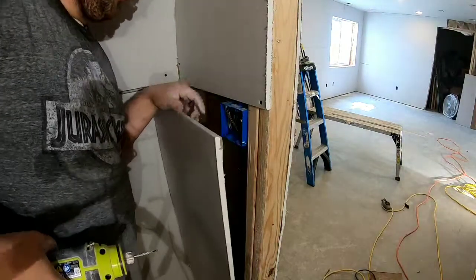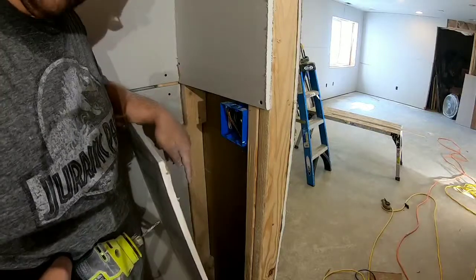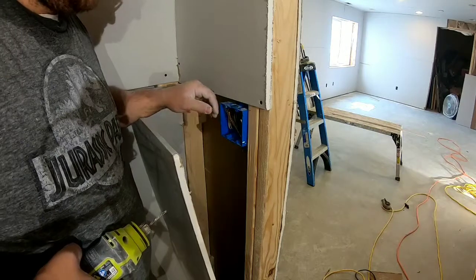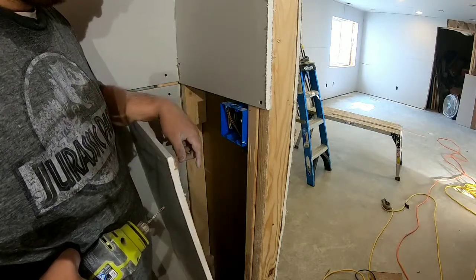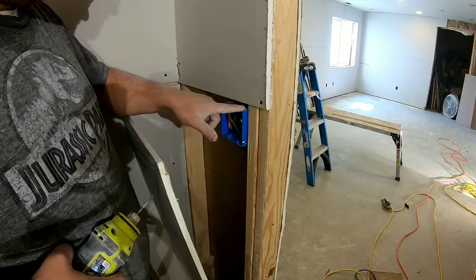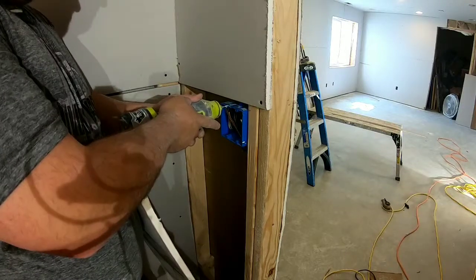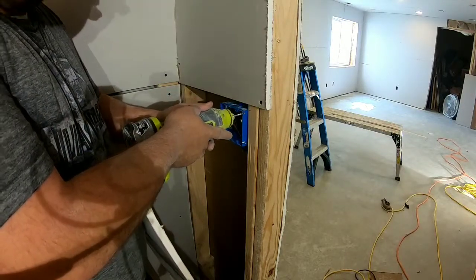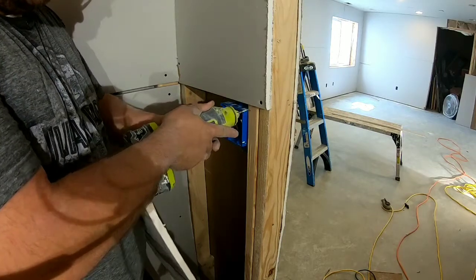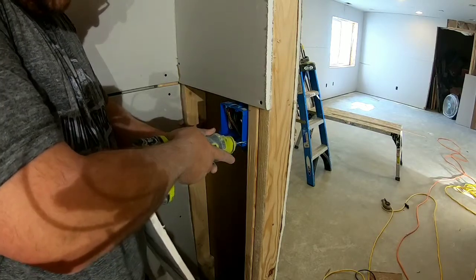Here I want to show you how to router. These switch outlets are a lot easier to router than the ground outlets, and I'll show you both. Just understand you're going to mess them up the first couple of times. Look at the outlet: we're smooth on three edges, but on this one edge there are two bumps. When you run your router over and go down, you're going to feel those bumps and have to move your router a little bit.